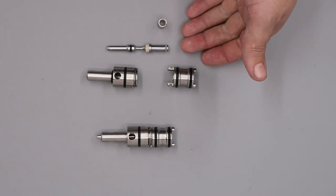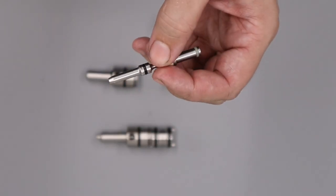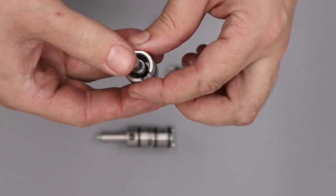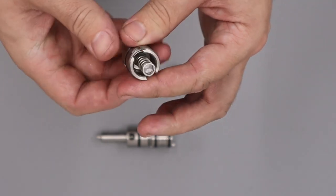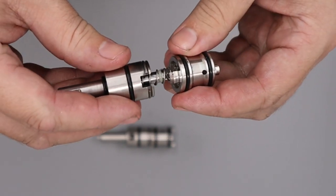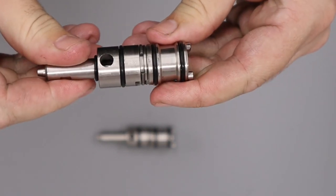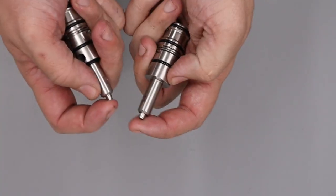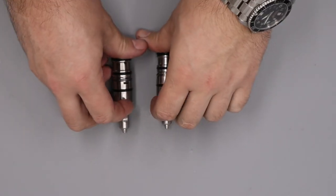The FAC valve goes together similarly. Add silicon grease to both o-rings — front and back — install into the front of the housing, add the valve return spring over the o-ring, then align the ring with the cutout in the side of the valve body and push the two halves together. Misalign the ring to lock it in place. Take both valves and check you can push the ends to confirm they're functioning correctly.